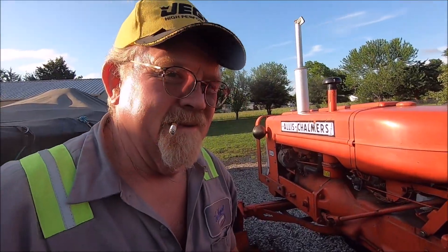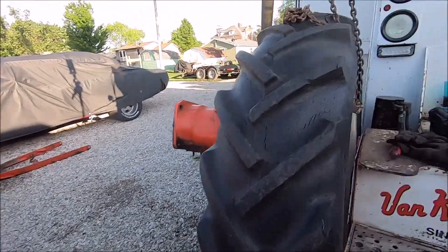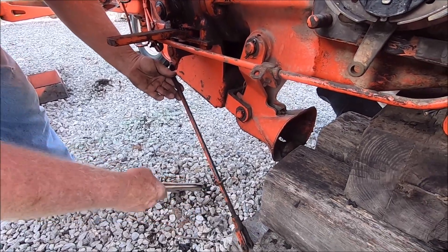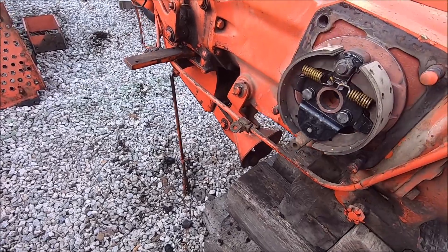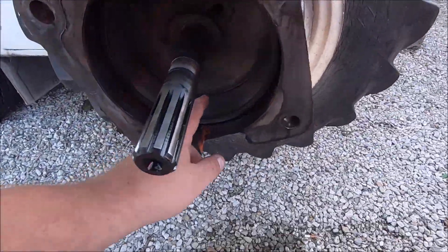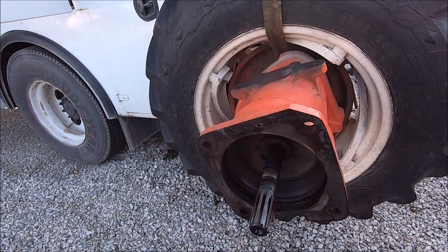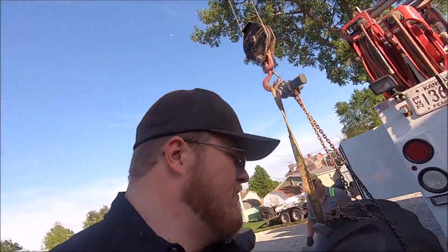You know it's doing your Allis Chalmers good. I had to modify the adjustment a little bit - you can take this cotter key out here and run this thread all the way back to adjust that. Now we've got a bunch of little stuff to do - get the gist of that. This is already cleaned; might spray this out one more time. You can take the flapper wheel and break that glaze off. A bunch of little stuff to do - need to clean this gasket surface. We'll check in - it's not too boring, and it's useful stuff you guys already know how to do.